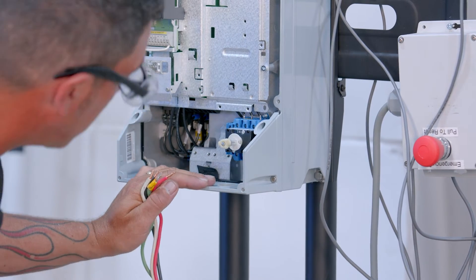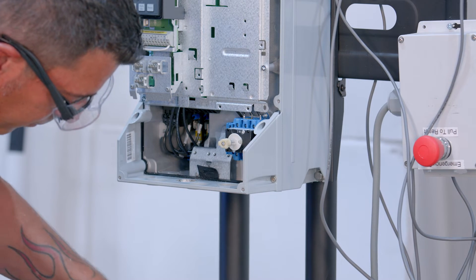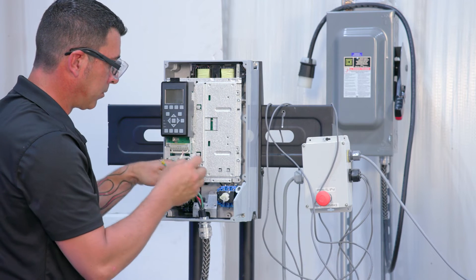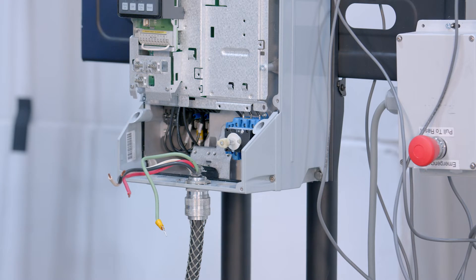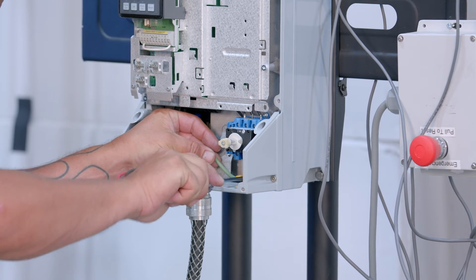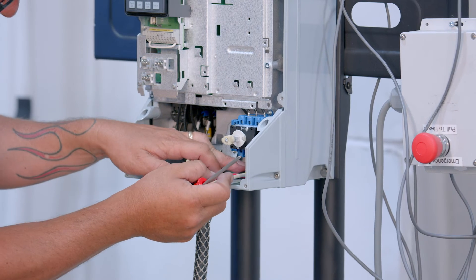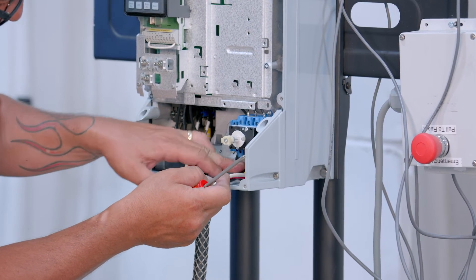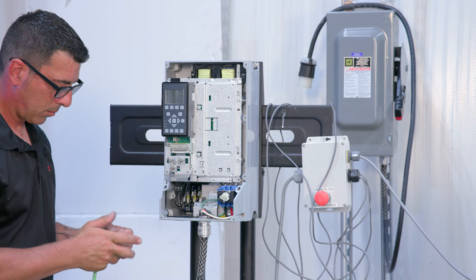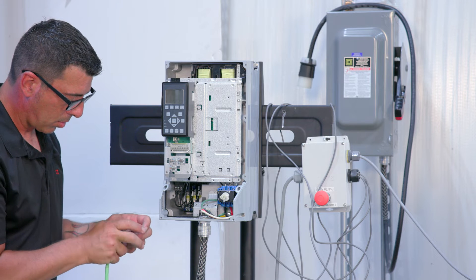You will need to cut a hole for your encoder cable. You will install separate cable glands for your incoming mains power, outgoing motor phase wiring, and your motor encoder cable at a minimum. Begin with the mains power — wire based on the instructions in your operator's manual. After wiring mains power to the mains disconnect switch, tug on all three wires to make sure they are properly secured. Now install the encoder cable going through the bottom of the drive, properly install your cable gland, and leave enough wire to properly wire your encoder cable to the drive.